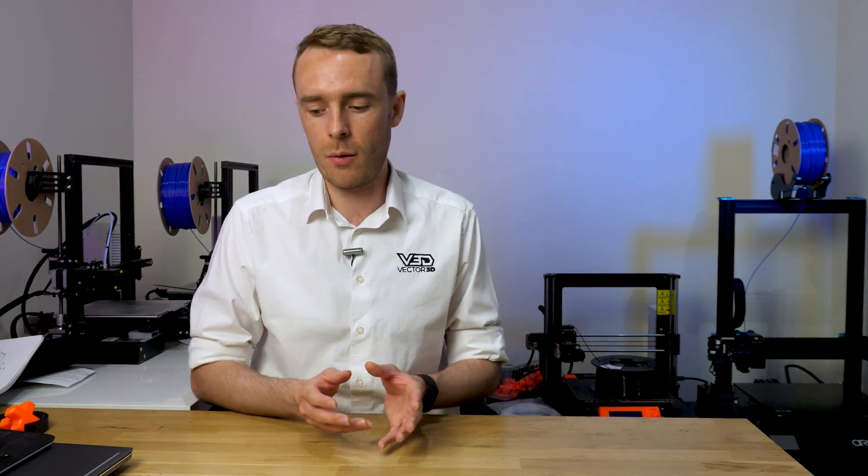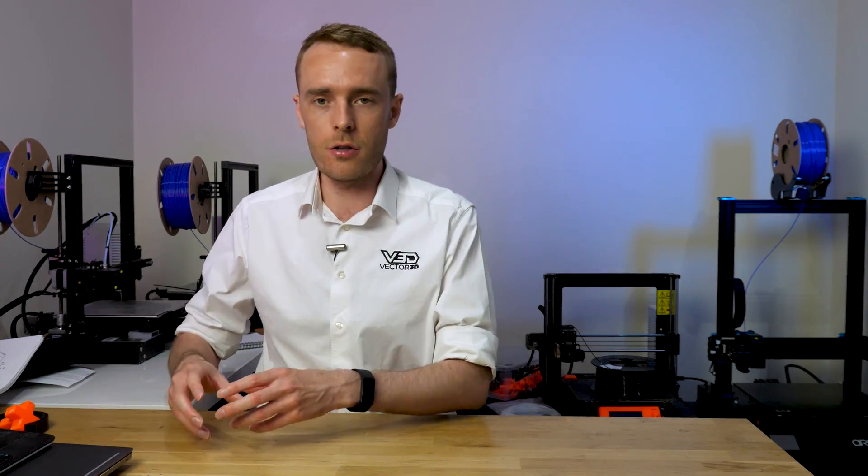Firstly, standard parts are nearly always cheaper than buying custom made. When something's standard, a company is typically making tens, hundreds or thousands of them, which means they get very good efficiency in the process and can reduce cost significantly. However, if you're only making one of something, all the setup times, production times and shipping times are just for that one item, making it very expensive. The second tip is that adhesive layers are a one-shot attempt because they are very strong adhesives that can withstand the temperatures you're going to be printing and heating at - you don't have any opportunity for wiggling or moving them.